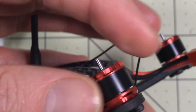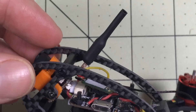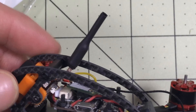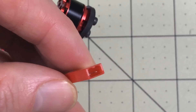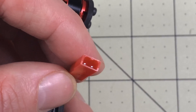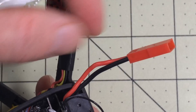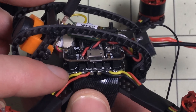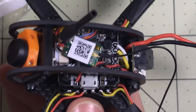The motors are completely unmarked, but they are supposed to be 1104 7500 KV motors. So that probably means this is going to be restricted to 2S, but that might be okay for the bigger props. It has a JST lead — please stop using JST leads, everyone. Everything should be XT30 now. 20 gauge wires, which aren't bad, but I'll probably take the whole thing off and run 18 gauge or better up to an XT30. There's a 4-in-1 ESC and a built-in flight controller, so it's pretty clean. The wire soldering isn't bad.